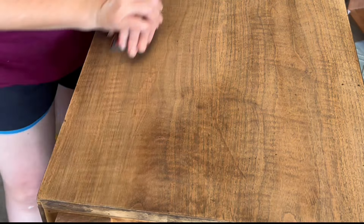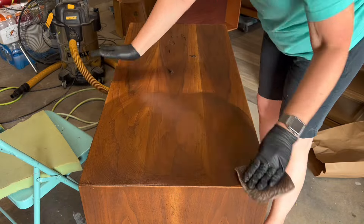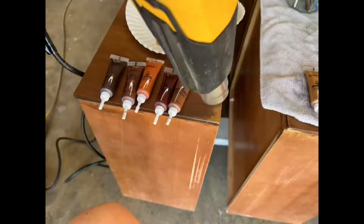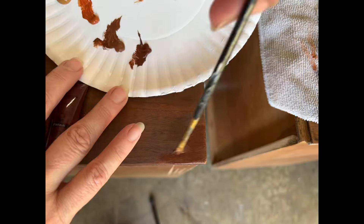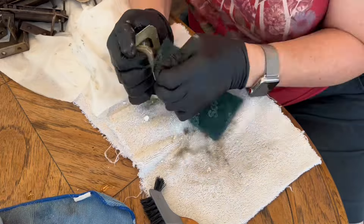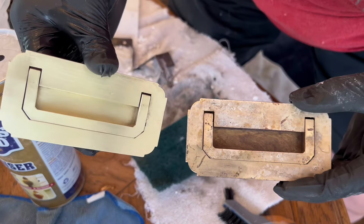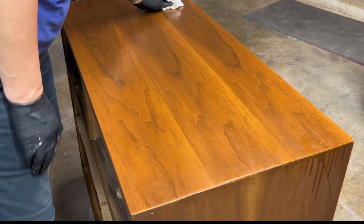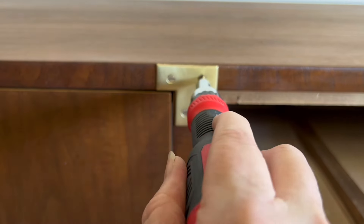After I stripped it, I went through the sanding process, then I was ready to stain. I'm using a 50/50 mixture of antique walnut and nutmeg. Then I'm ready to use a veneer kit just to touch up those little areas on that one corner. After the hardware soaked in vinegar and water, I cleaned it up with Bar Keeper's Friend. I'm using Osmo's Polyx hard wax oil to seal it up, then I'm ready to apply all of my brass accents.